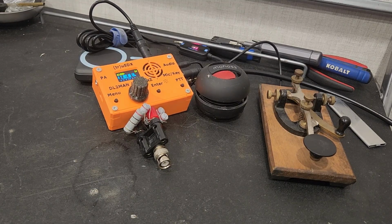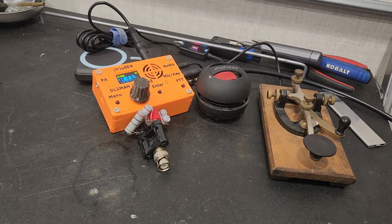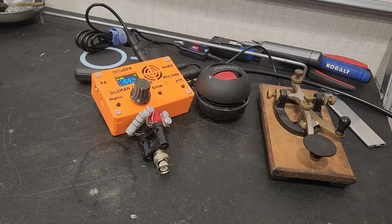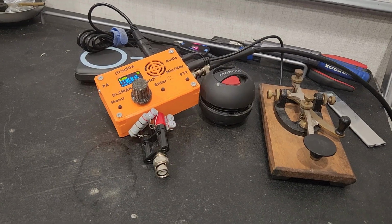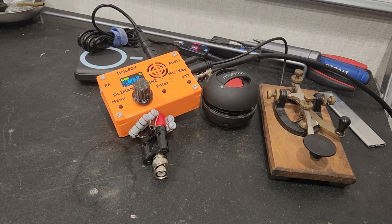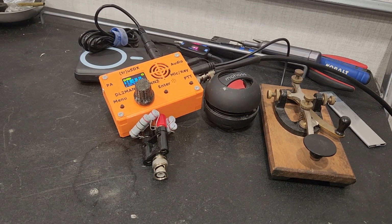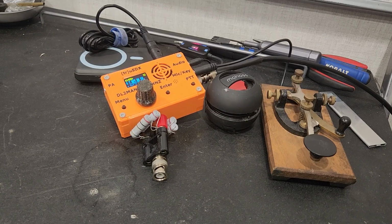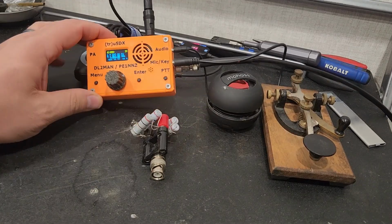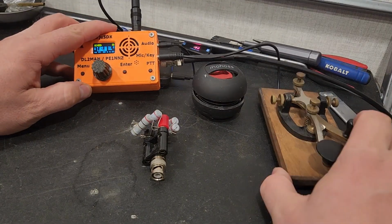And I'm just connecting the other end of this coax to the back of my MFJ 945 tuner, which is what the ZS6 BKW is going into. And you don't actually need much of a tuner on the ZS6 antenna. If you're not familiar with that antenna, it's like a G5RV, but it's much more resonant than a G5RV, thanks to some computer models and Smith charts. All right, so there you go. We're wired up.